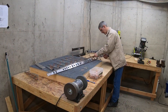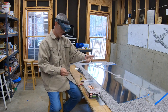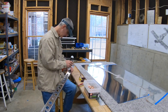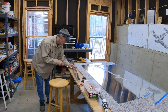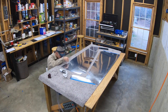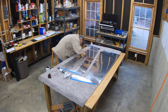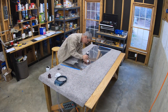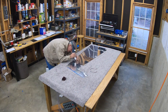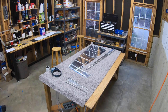Now that both of those are done, the next step is to take everything apart and deburr all the holes in the skeleton pieces and the skins and get them ready for dimpling. Also to go over all the edges and make sure everything is clean and deburred and ready for final assembly when that time comes. That takes a long time. I'll speed things up here and cut out a lot of pieces. It could seem kind of tedious, but it's also satisfying work because you're making things look nice and getting it ready for final assembly.